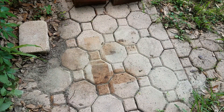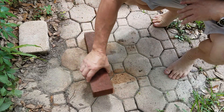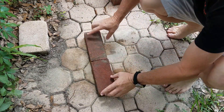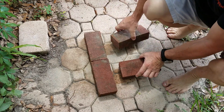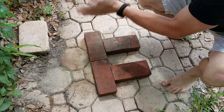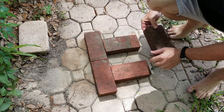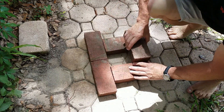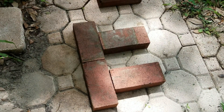Here's how you do it without cutting any bricks. First, set your first two bricks end to end, just like that. Your next two bricks are gonna come in at about the halfway point of the first two bricks — it don't matter if they're dirty. You want this to be about as wide as one brick, just to barely cover the opening. That is your foundation.